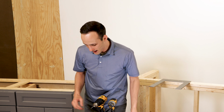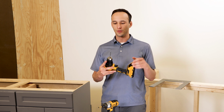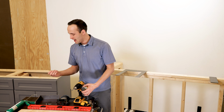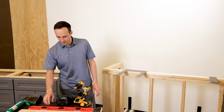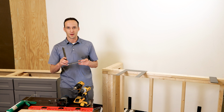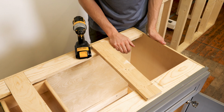And then from there, you're gonna need a drill, 3/16 inch bit, as well as your standard drill for a standard screw, and then 4 wood screws, as well as your leveler. You're also gonna need a router for routing out the top section of your cabinet and your Freedom countertop bracket.